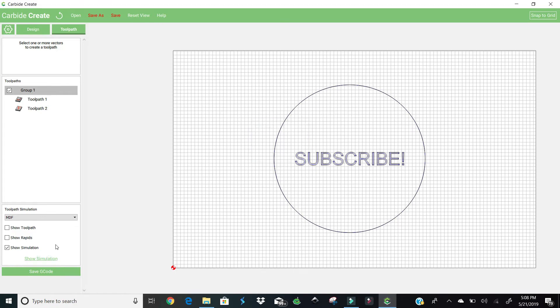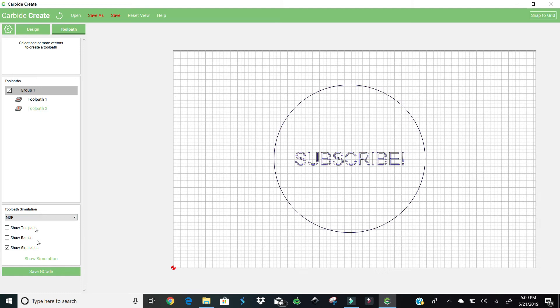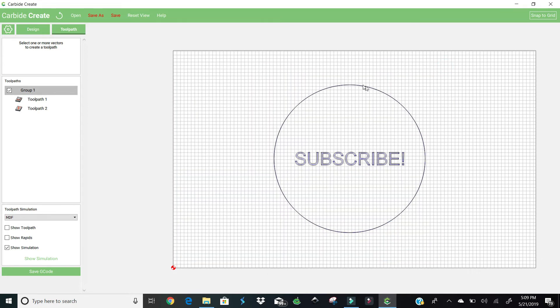Here's the issue: if I were to just hit Save G-code right now, it's going to save one G-code. When it sends to Carbide Motion and finishes the quarter inch, and I go to swap in the 301, that router is only going to come up so high — I won't be able to get my V-bit into the machine without taking the router out completely. On top of that, because I was zeroed out on toolpath one, how am I going to know where to put my V-bit in depth-wise? It's not going to be perfect. So we're going to create two separate G-codes so we can zero out each one and start from the exact same position.